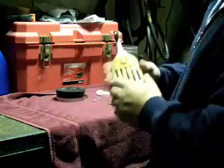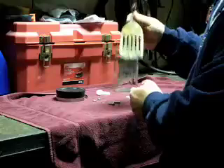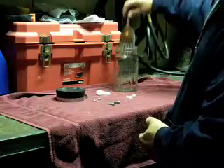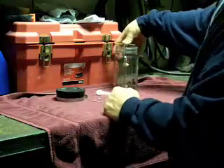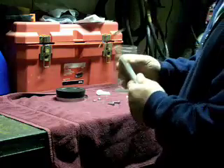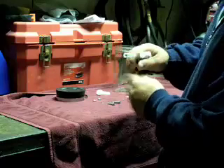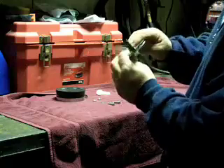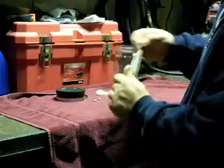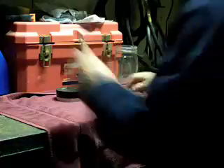To get started, take your spatulas. If they won't fit down in the jar, you'll have to shave, grind, or cut the sides down so they fit inside. Measure so the depth of the spatula sits at just above level when you put the cap on — that way the cap holds them down tight and they're not rattling around. Once you figure out the depth, bend the handles over, drill a hole in each one, clamp them together, drill more holes, and slide your quarter-twenty bolts through. Put a nut on as a spacer and tighten it up so you have a clean gap for the electrolyte process to happen.